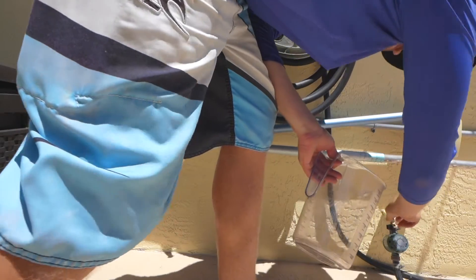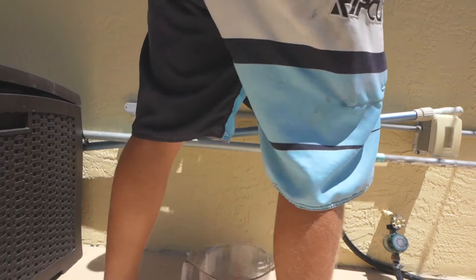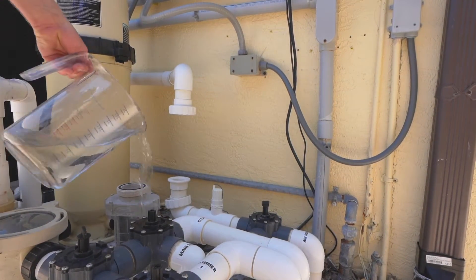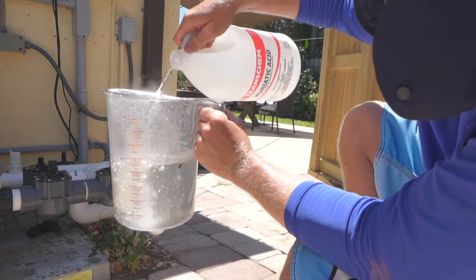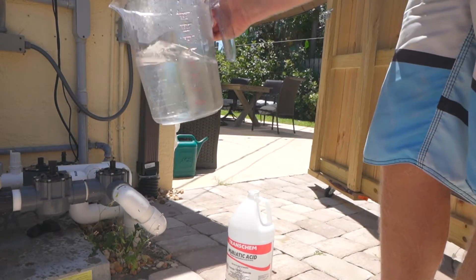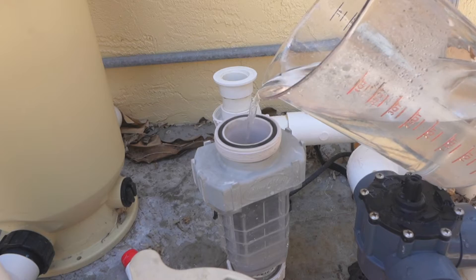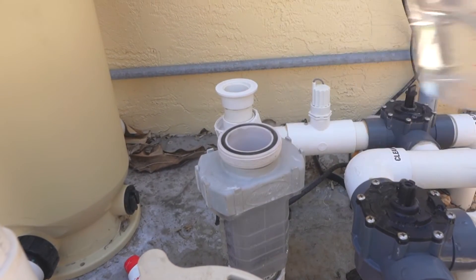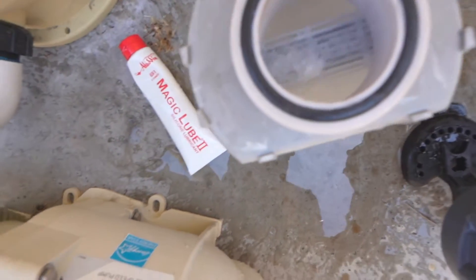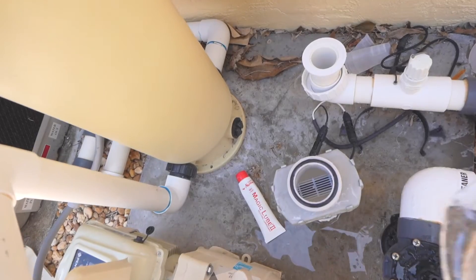Get some water in here. We're going to put a little water in the deck and splash our deck right here. We're going to do a one-to-four mixture of acid to water. Hold your breath when that is poured. We're just waiting until all the calcium dissolves and the bubbles stop — just top it off a little more.